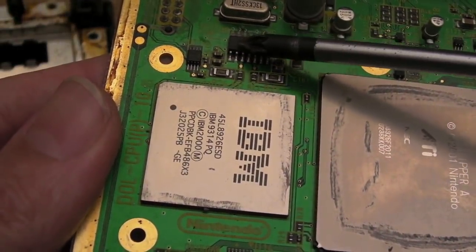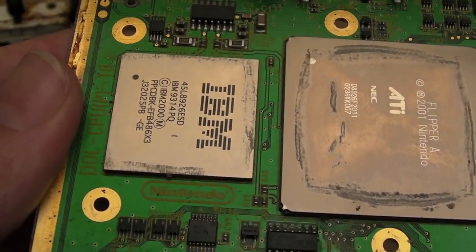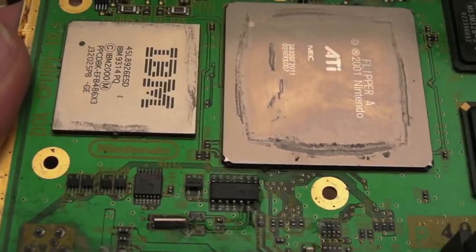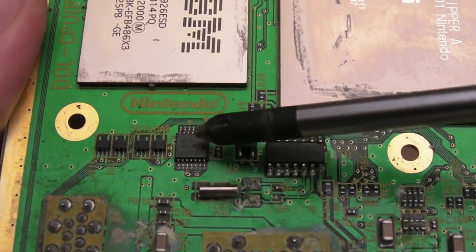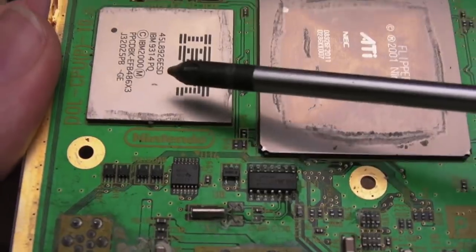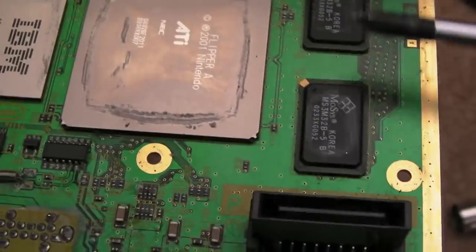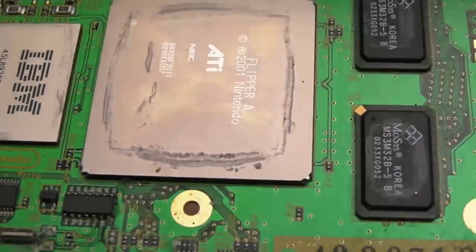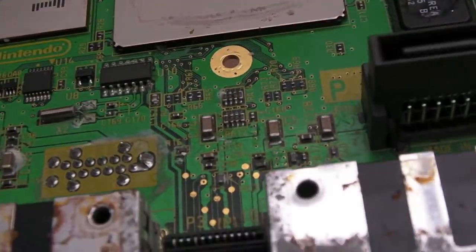I'll clean up around here with some cotton buds first, then remove this with hot air, take the one off the other board and swap them over and just see whether the other one springs to life. It'd be brilliant if it did. I suspect it's probably not going to be that, but we should rule it out — it could be the clock chip. My scope's not fast enough to scope the clock on this unfortunately. But if it's not those, it could be the CPU, GPU, or the RAM here — and it's all BGA mounted, so it's kind of out the realms of my capability at the moment. I haven't really got the right hardware to do something like that.